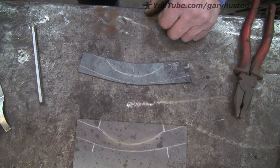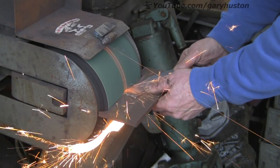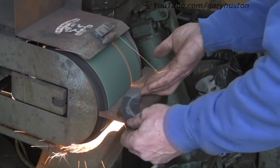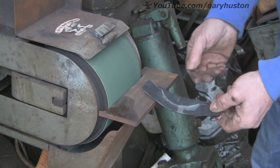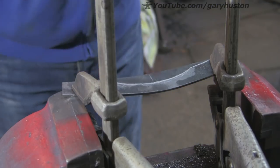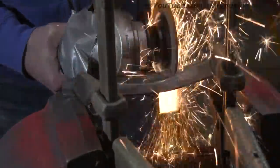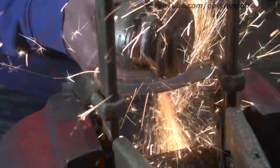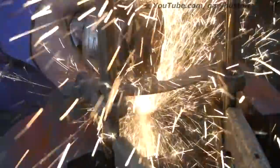This one I'm going to grind out, because on the last one I made I did it with the band saw, but not everyone's got a band saw. I thought most farriers who might want to make one of these have usually got access to grinders of some description - either their bowl grinder in the truck, or something like this in the workshop, or even just an angle grinder. And that's what I'm going to use for the next bit. I'm just going to whip the centre out. Now I've done the outside profile, I'm just going to take this bit out with an ordinary angle grinder. I've clamped it to the vise. I haven't annealed this because I'm grinding it out, so that actually cuts out a process - otherwise you'd have to anneal it, wait for it to cool down, which takes quite a long while if you want to anneal it properly.